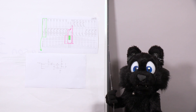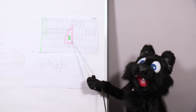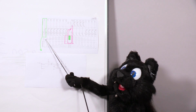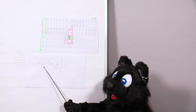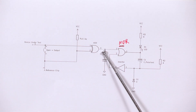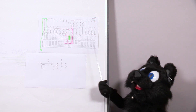Let's look at the circuit for a moment. It is rather simple — just 16 times the same, plus the power lines. Here's the test clip that provides the input to the device. All the lines get routed through the reference card. VCC and common lines are connected there, so now we have power. Each line from the clip also goes to one leg of an exclusive OR gate, and from there it goes via the reference card back to the other input. This connection is drilled out for the output pins of the IC — meaning the gate gets the same signal for all the inputs, and possibly a different one for all the outputs of the device under test. Being an exclusive OR, it will go high on the output if these are different. The NOR gate and the inverter are there to stretch the signals with the capacitor, and that's pretty much it. Rinse and repeat for the other 15 pins, and we are done!